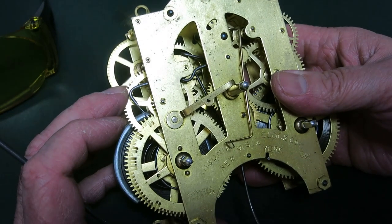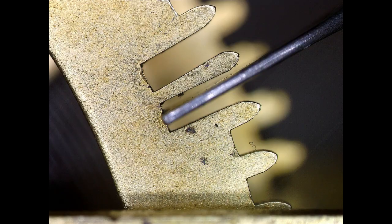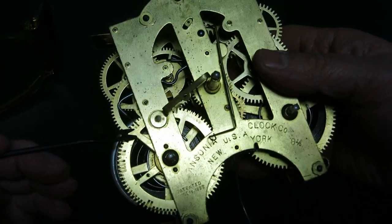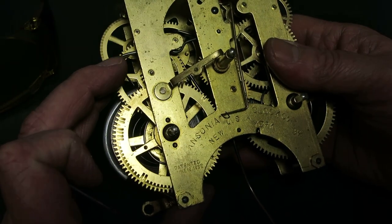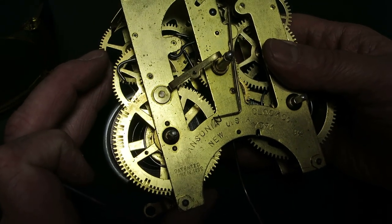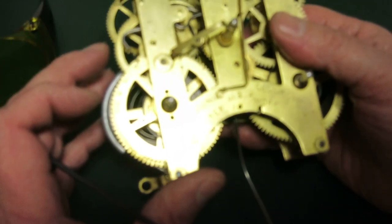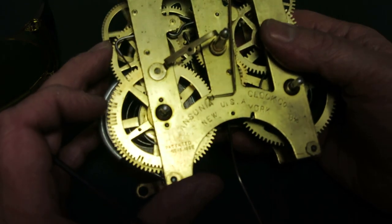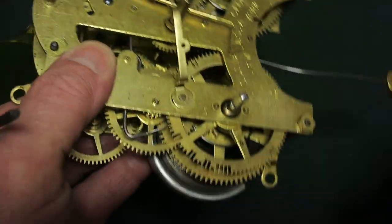drop or the count lever falls. Okay, oops. So that's where it fell. Oh, nice. It's right in the middle of the deep tooth, which is really good. So now I can, oops, I went backwards. I can go forward to the next test. And it drops there. And this is good too. It's centered pretty well. Because if it isn't centered, it winds up dragging up the top of the right side of the gap in the teeth, and it just makes a mess.